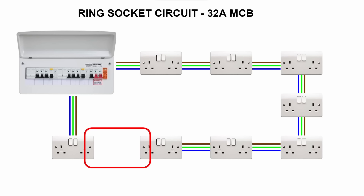The problem with ring circuits comes when you get a break in the ring. In my experience, breaks are usually loose cables coming out of the back of sockets where people haven't done the screws up tight enough. In a scenario where only one cable has come out of the back of the socket but the other one is still making contact, you won't notice any issues — all your sockets will still work perfectly — but you actually have a break in that ring.